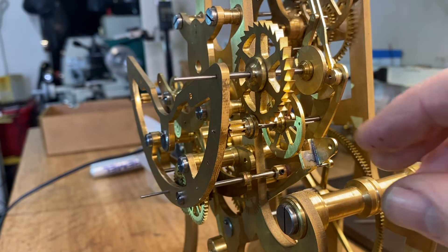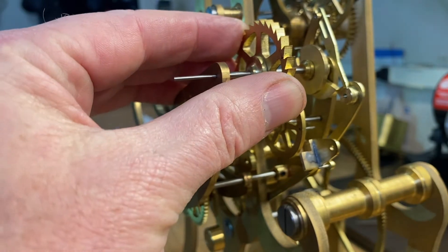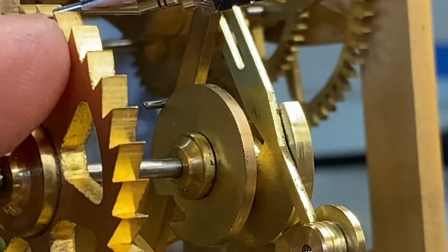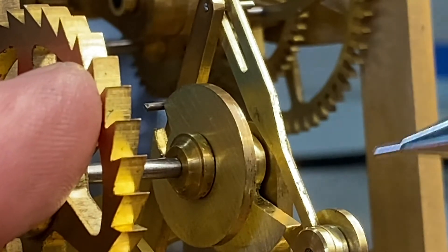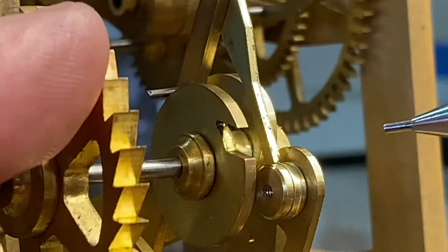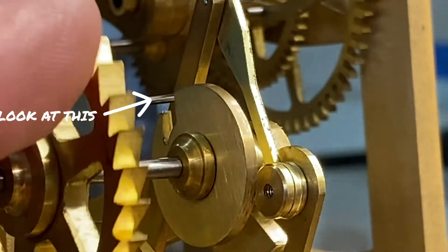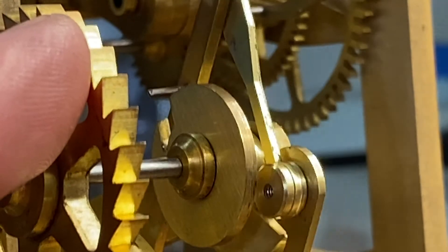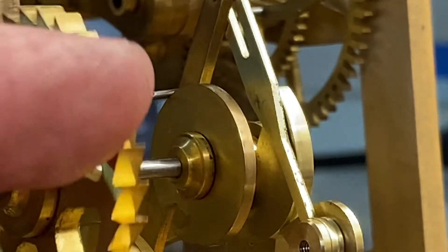Right here there's a little pin. That pin, as this goes on the first of every month, will jump into that slot. So as this cam comes around — remember, every day this wheel I'm turning with my finger is going to progress — it's going to come around and this is the end of the month, 31 days. You can see this is about to fall off this ledge right here. When it falls off the ledge it moves forward and indexes to the next month. Now the key piece is this pin on the backside — on a 31-day month that pin will not fall in that slot, it'll stay on top of the circle. Now it's falling in a little — that's a 30-day month.